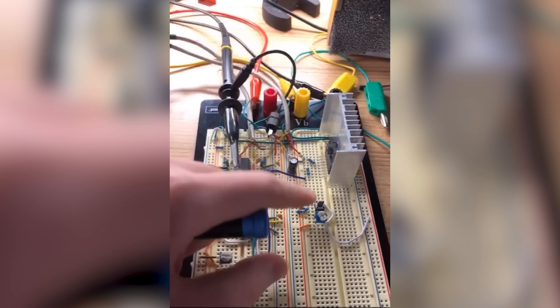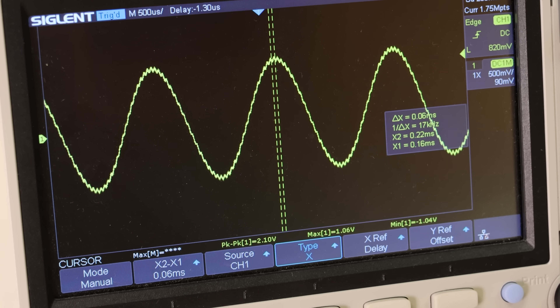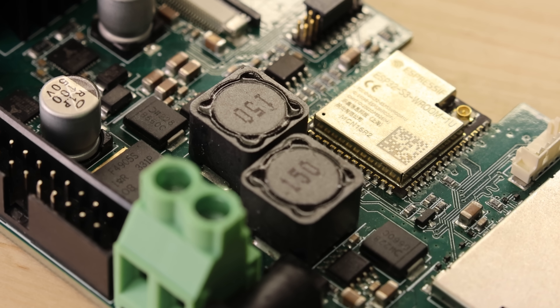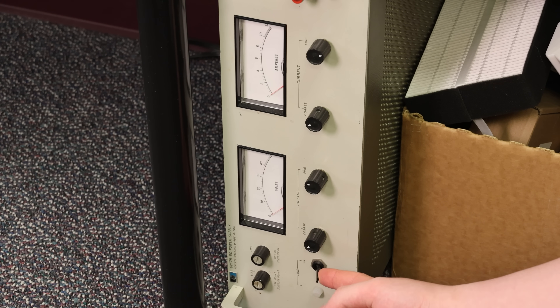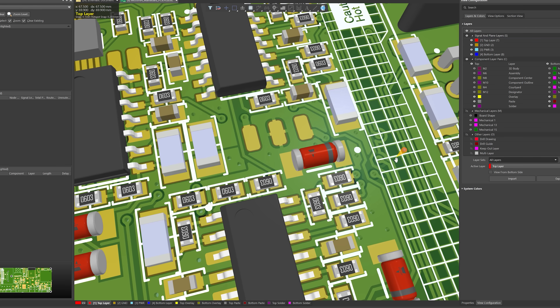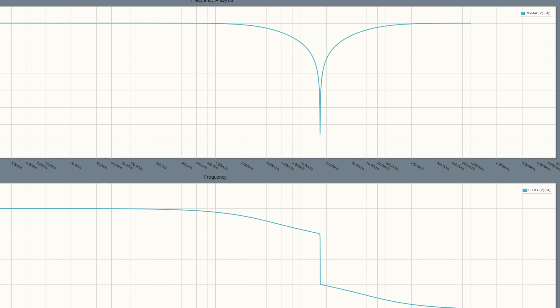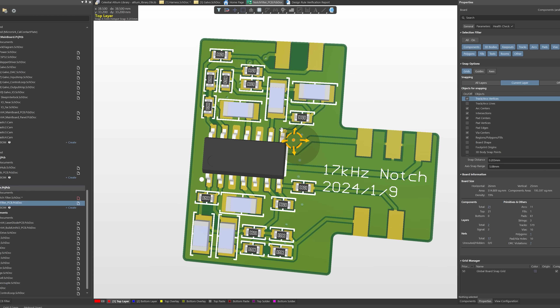We first tested our design on a breadboard. After some fine-tuning, we were satisfied with the stability and response. However, when we built the controller onto a PCB, there was a small but noticeable oscillation around the natural frequencies. This perplexed us for a little bit because we didn't change anything when transferring the design onto a PCB. Thankfully, we quickly realized that the harmonics of the switching voltage regulator were exciting the torsional modes of the shaft. The reason this wasn't an issue on our breadboard is because we were using a linear power supply for testing. To overcome this, we first tried adding a simple RC notch filter to the output stage. However, the filter was not only filtering out the resonance, but also messing up the rest of the control loop. Therefore, we decided to switch to a multiple feedback active notch filter to avoid having to retune the entire control loop. After this modification, the controller became very stable and was able to track second-order quadratic inputs with zero steady-state error.